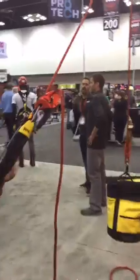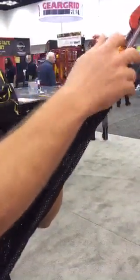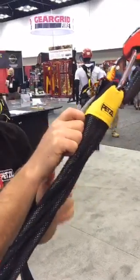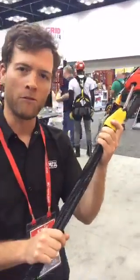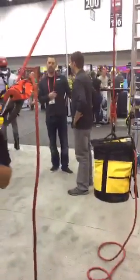It's got basically 32 inches of pull. It's primarily used for hauling in short directions. The best utility for it, I would say, is like a pick-off. If someone has fallen on a lanyard or fall arrest device and they can't pull themselves off, it's a great little thing to bring them right off that lanyard and then transfer them over to another system.